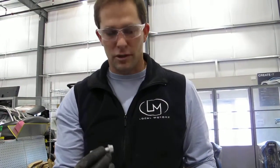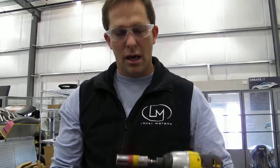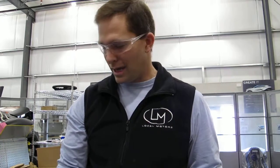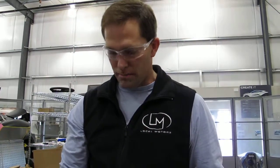This should be done under the supervision of a builder trainer to make sure they don't get cross-threaded and don't get over-torqued. Typically the torque of a fresh battery in this impact gun is only up to 30 foot-pounds, so even if I drove it all the way in it should still be shy of the 37 foot-pounds needed on these bolts. Then we'll have it mated, that will be the end of the step, and we'll mark the bolts.